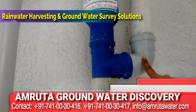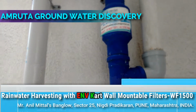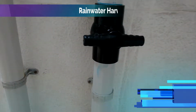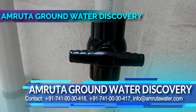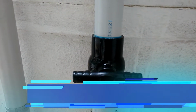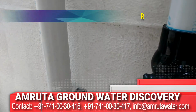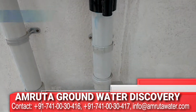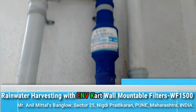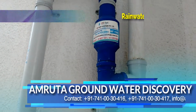You can see this is the rooftop downtake pipe, and it is joined here as an inlet to the ENV Kart's WF-1500. This is the first flush pipe, and this is the first flush valve. Once the initial rainfall has come, the impurities, the dust particles and debris, get trapped here. Once the valve is opened, the dirty water comes down. The impurities get trapped in this first flush system, and the rainwater travels upwards into the rainwater harvesting filter, ENV Kart Systems WF-1500.